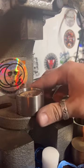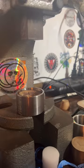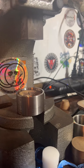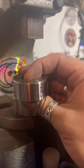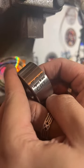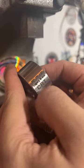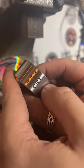If you'd like to get started doing this, I initially focused on one specific coin. So I focused on quarters, and that kind of limited the required tools I needed. So when working on quarters, you really only need one die. This is the one I recommend. This is a 1 inch by 0.9 inch 17 degree die. You can get them from Jason's Works or Legacy Brand. Legacy Brand's a little cheaper. They're both good tools.